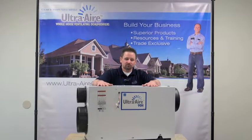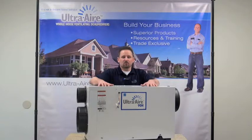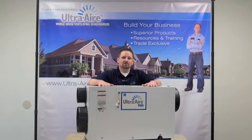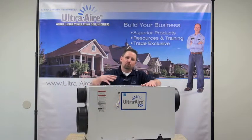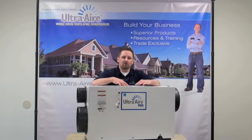The most efficient in its category. Part of the way that we are able to achieve these high levels of efficiency is through unique technology that we use with the UltraAir products, which is a cross flow air technology. Essentially, there is an air-to-air heat exchange core inside the unit, where we precondition the incoming air with air that just came off the evaporative coil to precool it, to hit dew point more readily, and remove more moisture per unit of energy put into the product.